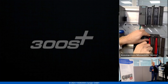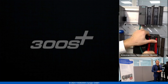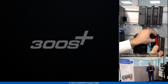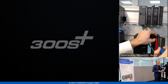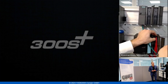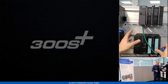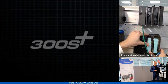The CPU you see at the top here, the Siemens one, you may see on your screen. It's a CPU 315 2PN, which is comparable with the 315 2PN from Yaskawa. On the modules you see on the right side, these are one digital input module and one digital output module. At Yaskawa, we have the same modules, which are the option to the Siemens modules accordingly. So that's what you see at the top.